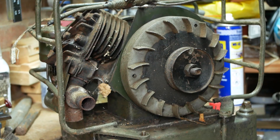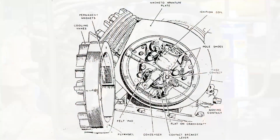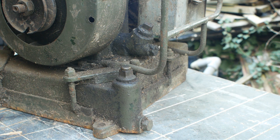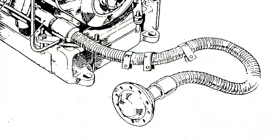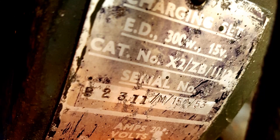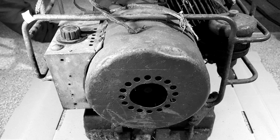Anyway, that's as far as I've got so far. The next step is to check for a spark, and I fully expect to be stripping the flywheel off to get at the points. I need to change the oil, and I ought really to drop the fuel tank to clean out any rust, although I'm half tempted just to flush it out a few times. I need to make a silencer to go on the end of the flexible exhaust pipe, but I'm just dying to get it started. That can wait for part 2. If you've enjoyed watching, please like the video and maybe even subscribe to the channel, not forgetting to click on the bell icon so you get notifications when future videos are released.